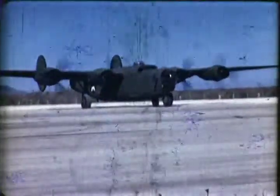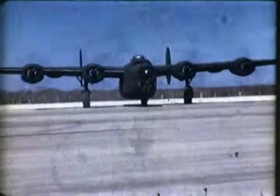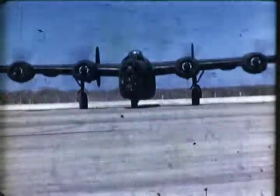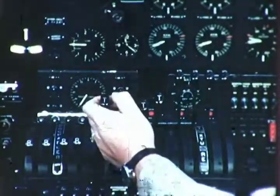The airplane has been properly warmed up, prepared for flight, and is taxiing out to the take-off area. On arriving at the head of the runway, the pilot stops the airplane and sets the parking brakes again. Press the pedals, lift the parking lever, and the brakes are on. And now comes the final check, an engine run-up, preparatory to take-off.